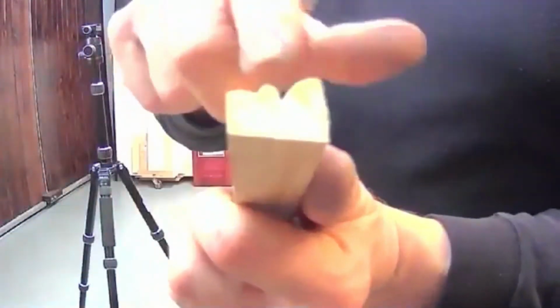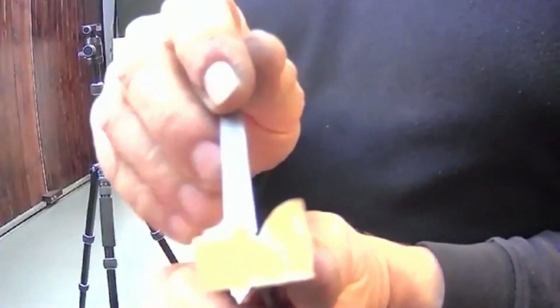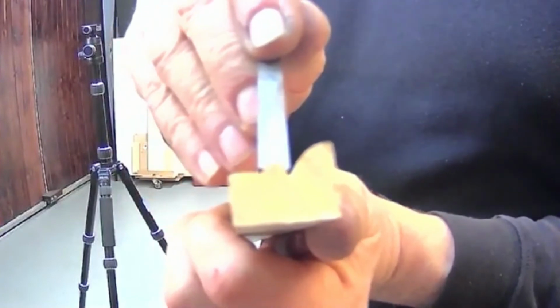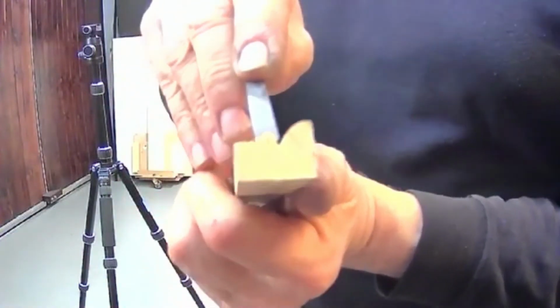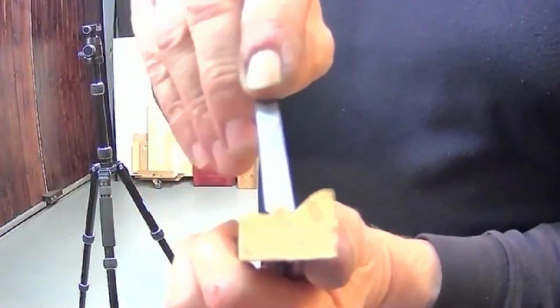And so I knew I could cut this part of the profile. This obviously was just an 1/8 inch bead, so it was pretty evident. Now the beading cutter that I used for this had slightly longer legs, and it's the one we'll use to reproduce this. It's very difficult to focus, I apologize. And then we just need to create this flat.